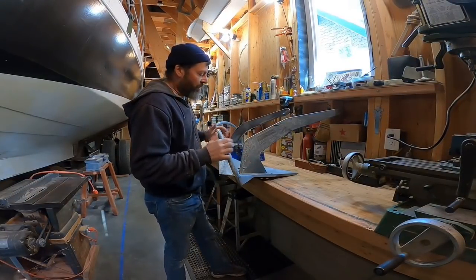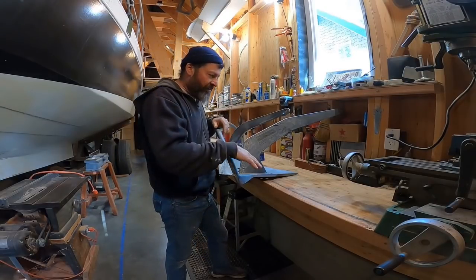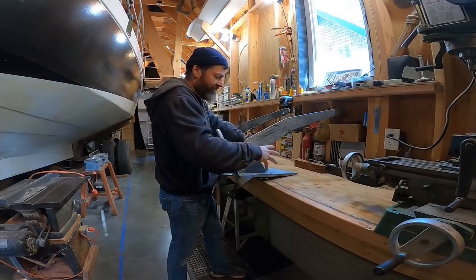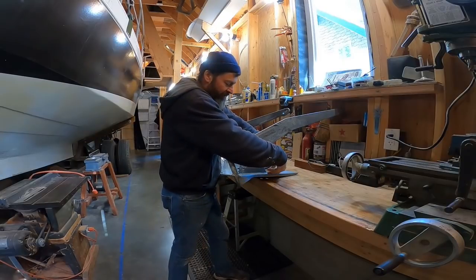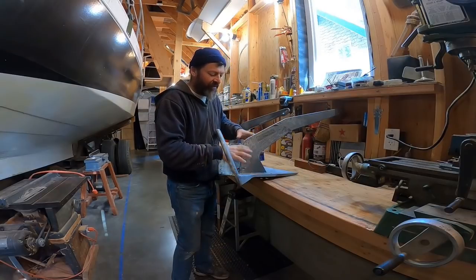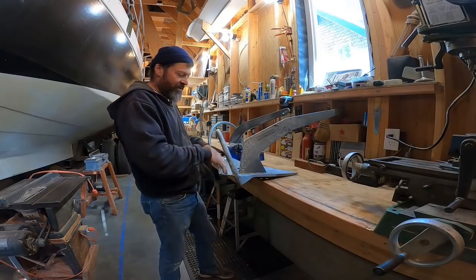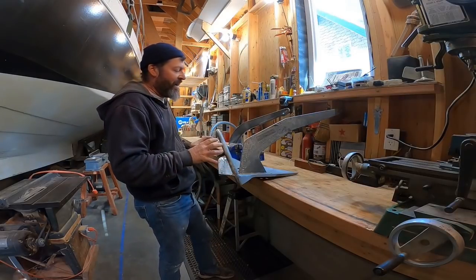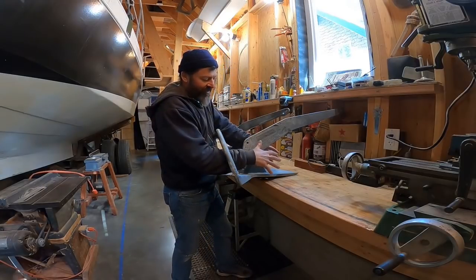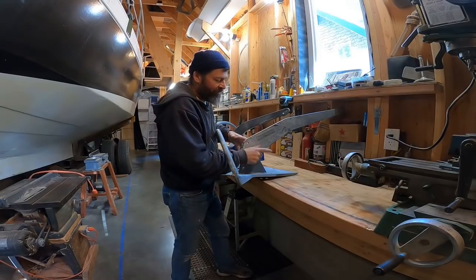So here's what I think was going on with this anchor before I modified it. The anchor initially set perfectly, but at some point in its motion, the seabed directly over the anchor could no longer pass through. Whether it was friction or stickiness, suction, we had a roll bar here that could grab part of it, and then these turned up flukes. I think that all conspired to cling or grab a hold of the seabed directly over the anchor, and then that seabed became part of the anchor and started moving with it.